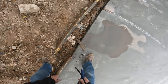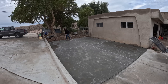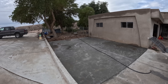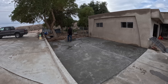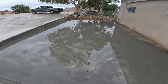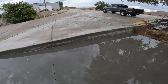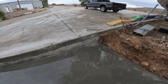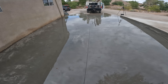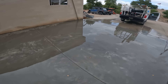There's your form coming out. I've got my cuts in and we're looking really clean. This thing is flat as a pancake — I was very surprised, considering we were working between two fixed structures and I had to kind of freehand it almost. I had some overhead screeds set up, but a lot of it was freehand because I couldn't snap a line along that backside of the curb — it didn't go down low enough. So I had to hang some screeds over there. It was a tricky application, but from what I'm looking at right now, I think we got it done. I'm proud to say I will be happy to go back to this job any point in time to do more work if needed.